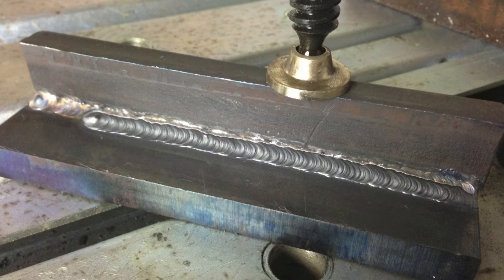I wanted to make sure that I kept the puddle full and added in filler just as needed. On the third pass, I kept the tungsten pointed towards the upper edge of the second weld, also making sure that I melted in and absorbed the top edge of the first weld.